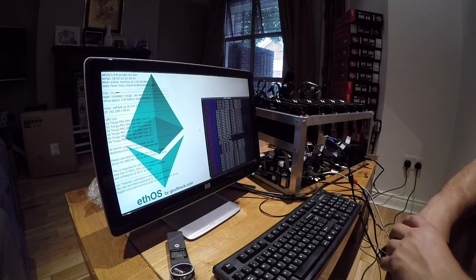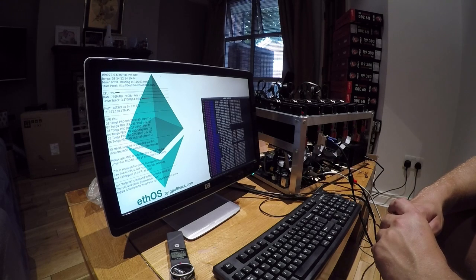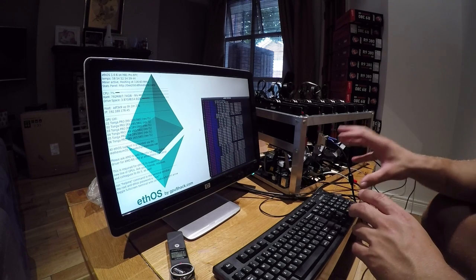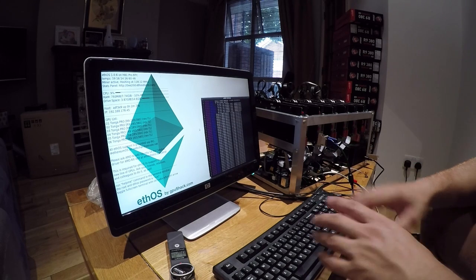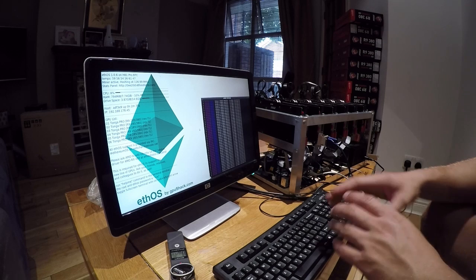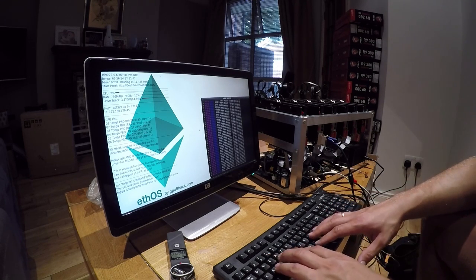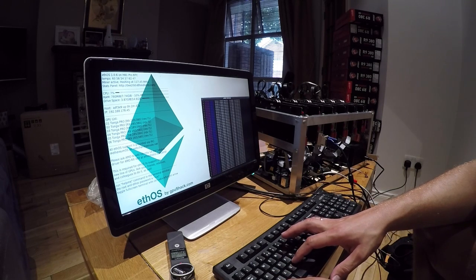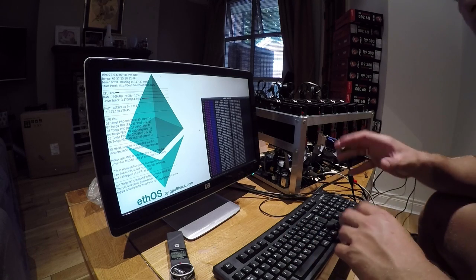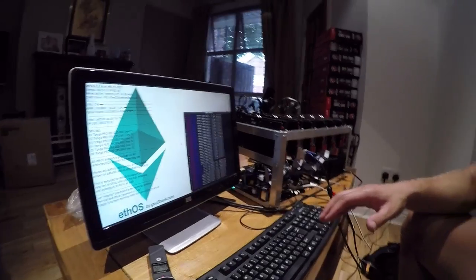So these settings are 1000 clock and 1500 core clock. These cards don't like that. You see, it does about 118 mega hash, 116. So yeah, we will change that for the other, but I'll be posting in the description which are the best settings to run all these cards. So that's probably it for this video.